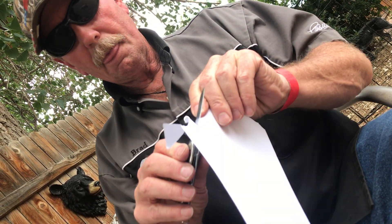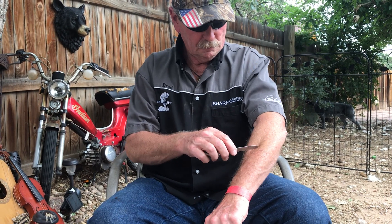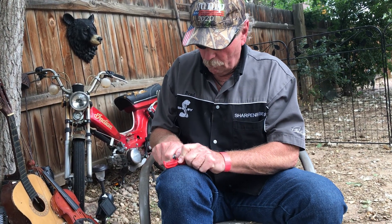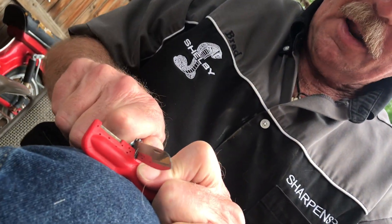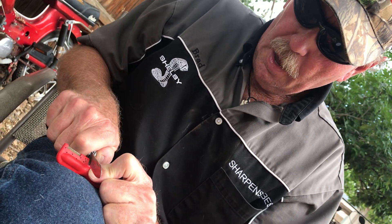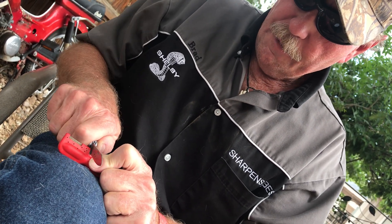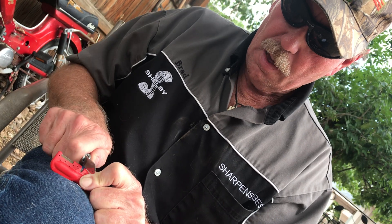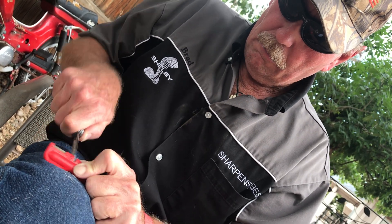It's still going to take... that knife is incredibly thick. Out here at the tip, it's that thick. That's dull. I'm bound and determined not to quit because I usually don't quit. So let's press harder, work a little faster, cut that blade down. It takes an awful lot to cut a blade down three thousandths of an inch even though it's taking off big pieces. If that cutting edge is three thousandths of an inch wide, you have to cut down at least three thousandths of an inch on each side of the knife to get it down to the cutting edge.